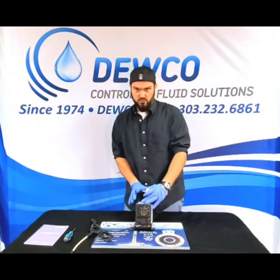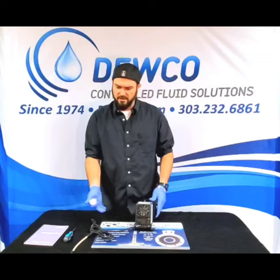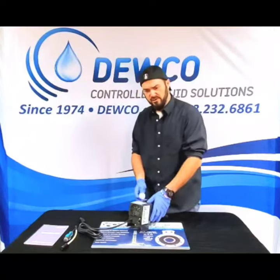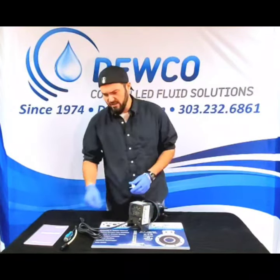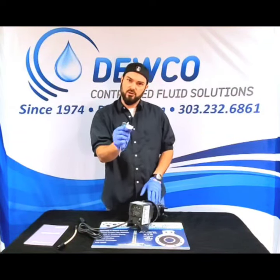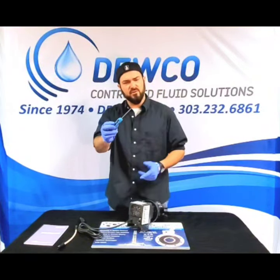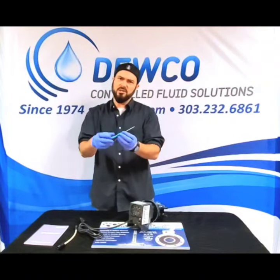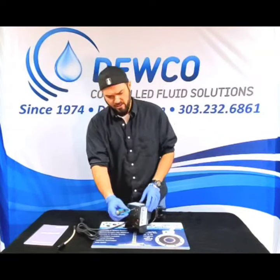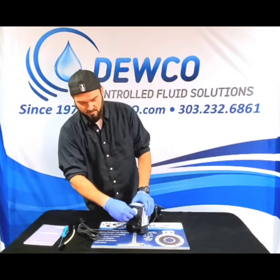This piece is to stop the motor from spinning when you try to expand and contract the roller assembly — which you need to do to extract and insert the new pump tube. The motor will spin freely without something obstructing the fan. They should come with every two-pack and five-pack of Stenner tubes, but if missing you can use a small thin screwdriver to keep the fan from spinning. The piece slides right in between the fan blades — boom, locked up.